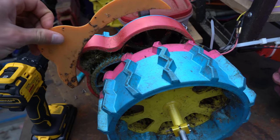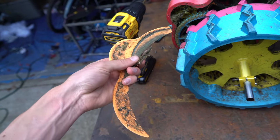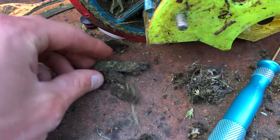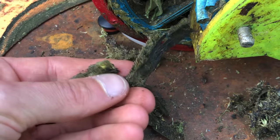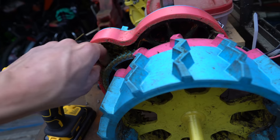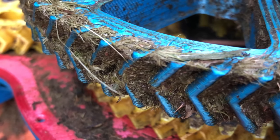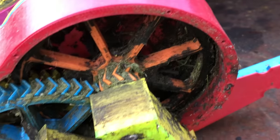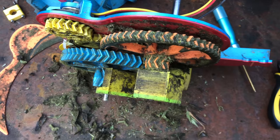I'm about to take this cover off for the first time. It definitely has the same type of residue that's on the inside of lawnmowers. This is the gear that's bound up and I want to know why. The teeth are just — this is kind of what I expected — I guess I expected the grass to smoosh down more. But these gears are just kind of rolling on each other, not really meshing together as much as they should. I'm actually surprised the teeth aren't gunked up even more than they are. It still looks operable, which makes sense because it was operating earlier today.